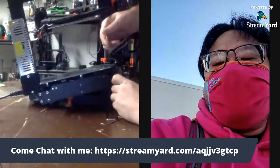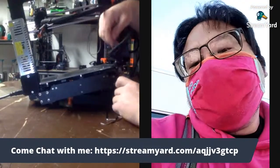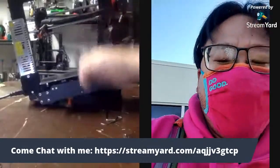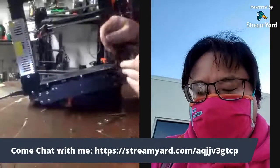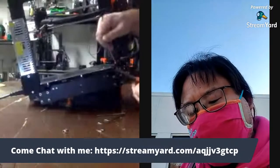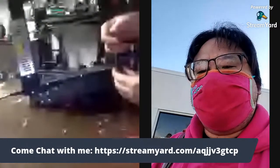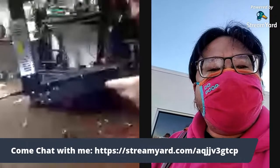Is it just a sheet of steel or aluminum, or what is it made of? So I think this is a metal board with kind of like toaster wire underneath it. It gets hot, and then on top of that I put a magnetic heat bed. I assembled this once, so I should know what is in here. But I think there's just some heavy gauge wire that is directly soldered to the bed. And this plastic piece I'm taking off now, its job is to keep that connection from flexing.